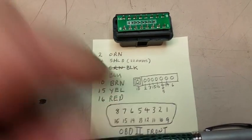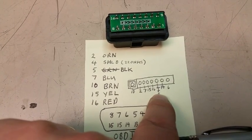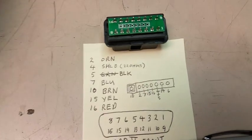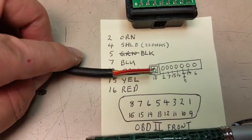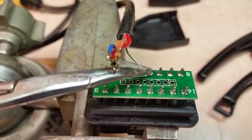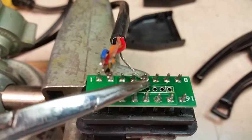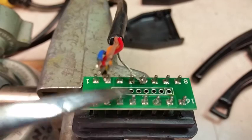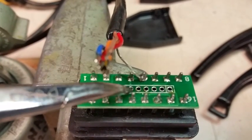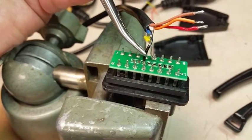Using my meter, I figured out where these holes go and I've marked them down. Interestingly, pins four and five share one hole on the connector side. After you get your wires tinned, go ahead and put a loop in the wire that wraps around pin five — because four and five are supposed to be bridged together, but there's not enough room in one hole for both wires. Put one wire here and the other there, then put the black wire in its spot. Now go ahead and get all the wires installed — you can use a pair of curved forceps to hold them down while you solder.